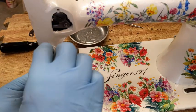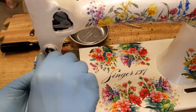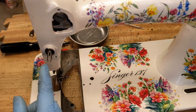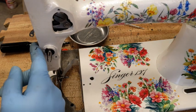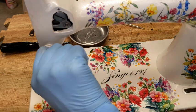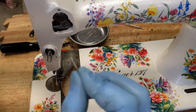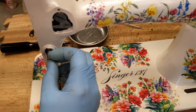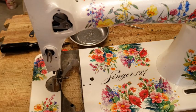Okay, so first I put the spring around the post, and I'm holding it down here at the bottom, and I am screwing that in, and that's going to hold the spring tight. Now I can lift the spring so it can rest against this little bottom of the cutout there, and if I lift it up, it's got some spring, so it's doing what it needs to do. Okay, so next, this is the little tension release pin, and it goes in there. You push it back like that.